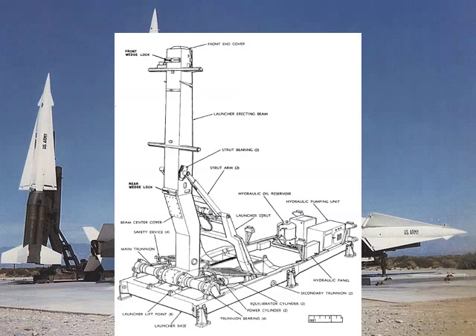But everywhere you go on Fort Bliss or McGregor Range you'll see this big cigarette butt ashtray rocket motor nozzle — from the Nike Hercules booster rocket motors, because they had so many of them. Here's a close-up of the launcher. The picture does not do this thing justice — it is absolutely steampunk massive heavy steel. This trunnion bearing at the back of the launcher is probably a foot in diameter. The hydraulic pistons, two on either side, are six inches in diameter and there are four of them. When you turn this thing on to erect it, it screams because of so much hydraulic pressure going through those valves. It would take the launcher with the round on it 45 to 60 seconds to go from horizontal to vertical.